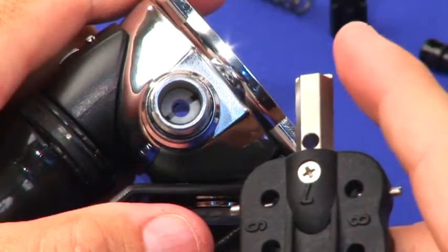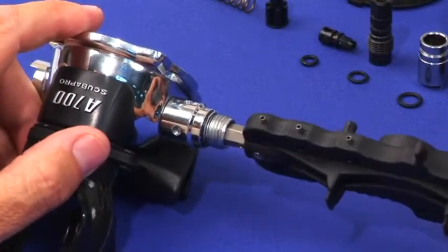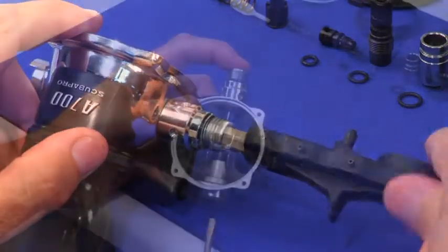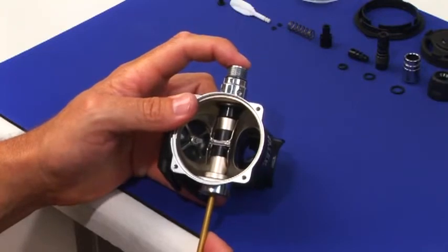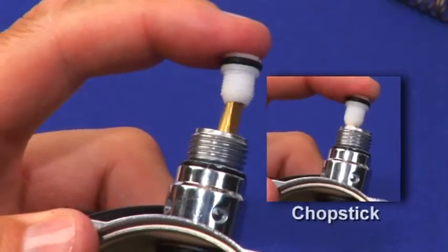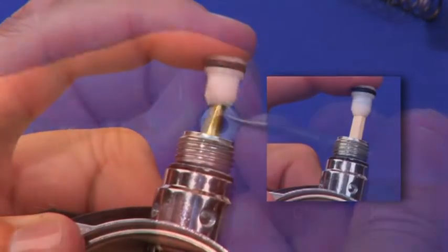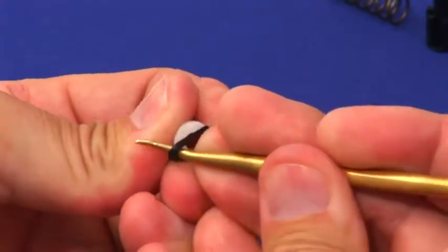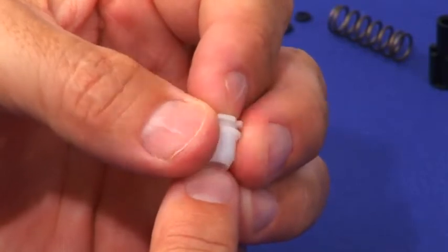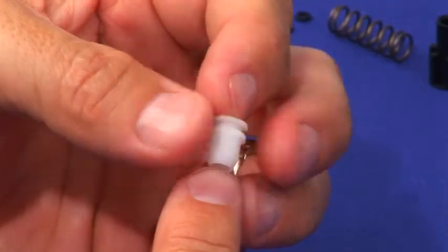Fully engage function number seven into the back slots of the adjustable orifice. Unscrew counterclockwise until the threads have disengaged approximately four rotations. Expel the adjustable orifice with care by pushing slowly from the knob side of the inlet tube. Your tool of choice must clear the lever tabs and orifice knife edge. Remove the O-ring with a soft brass pick. Now thoroughly inspect the knife edge surface using your fingernail to detect any nicks or imperfections by rotating the orifice back and forth.